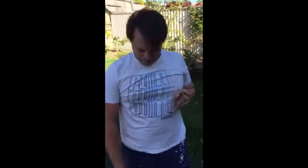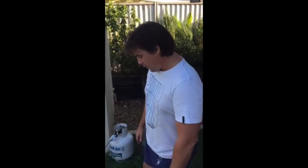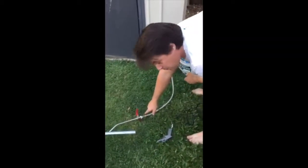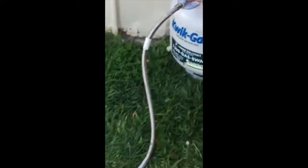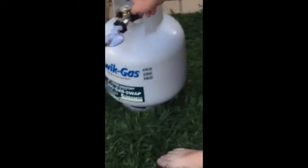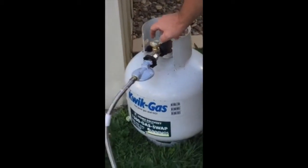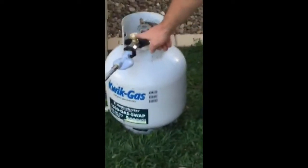And that's our mould. So now what we're going to do is heat this up, melt the brass, and pour it straight into our mould. Alright, on here I've got 2 safety valves that we can turn off at any time if there's an emergency. Up here I've got another safety valve, and up here I've got a safety regulator which tells me if there's a leak, it will shut itself off, and that's what you want.